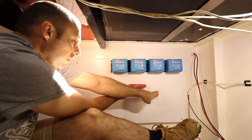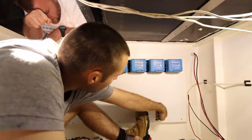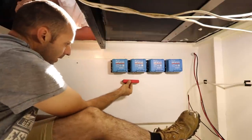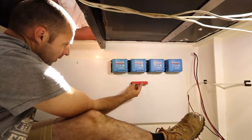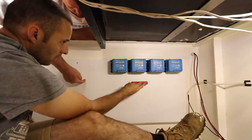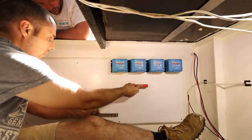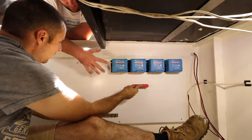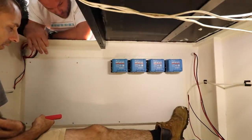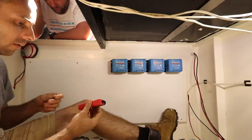So relatively close to these charge controllers — I like that. Wind will come straight in over here too, with a switch next to it, and wind down here allowing whatever space is needed. Let's keep this up like that. Give yourself a little bit of play room for corner radius of the cables, especially when you put them all into the same loom — you'll need a left and then a right. So bring it down — I reckon that's perfect. We're going to have our earth down the bottom here, which separates all the positive connections at the top with earth at the bottom. Noting that you don't want anything to fall down into the earth, but it's less dangerous than falling into a positive — that's why we circuit break them all.